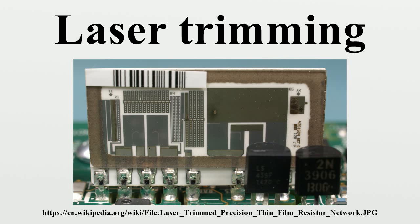Trimming potentiometers: often designers use potentiometers, which are adjusted during end testing until the desired function of the circuit is reached. In many applications, the end user of the product would prefer not to have potentiometers, as they can drift, be misadjusted, or develop noise. Therefore, manufacturers determine the needed resistance or capacitance values by measurement and calculation methods and afterwards solder the suitable component into the final PCB.